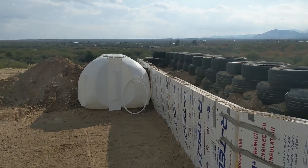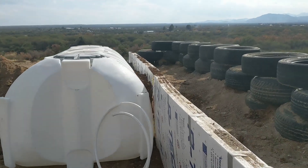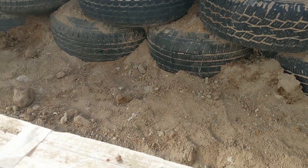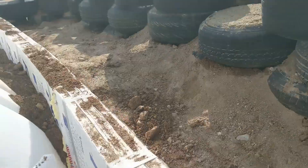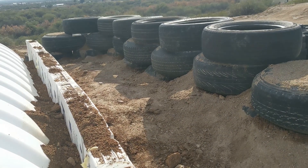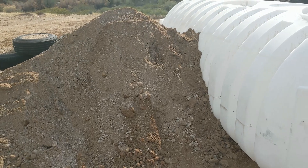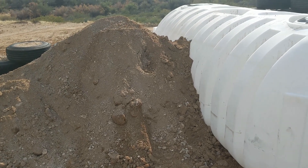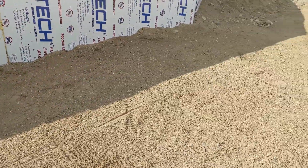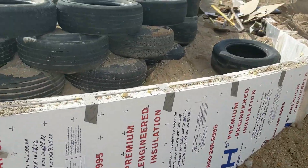On this model the water tanks are on the side and there's not too much space to maneuver. So what I have to do is put a tank in and kind of put dirt next to the tank using the tractor, then shovel it in by hand to increase the dirt level behind the tires. The tank's empty right now, so I made a dirt pile here to keep everything in place. Once I've done that I can put in the second tank next to it.